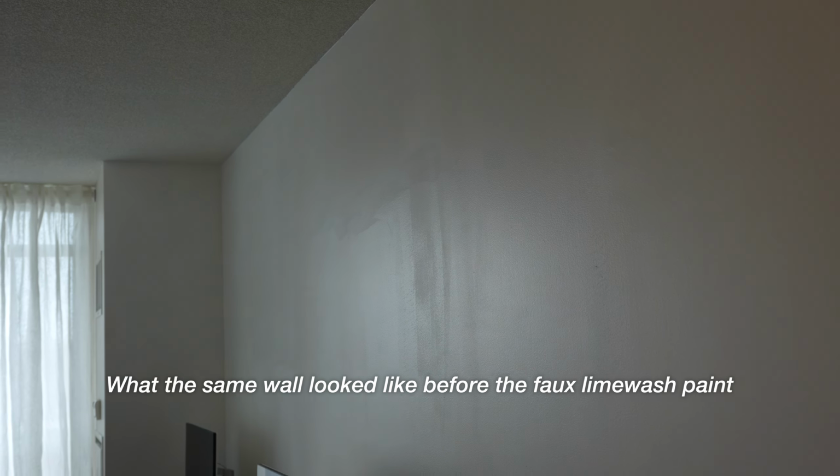The sheen in those areas does not seamlessly blend in with the rest of the wall because it was done at a different time. So in the same way that when you do regular paint and you apply it with a roller, if you have a section that you patch up later, you see the paint stroke lines from where you did that touch-up paint when it is shining in the natural light. And there's really no way around that. For you to get rid of those lines, you would have to basically paint your entire wall again so that those lines are hidden.